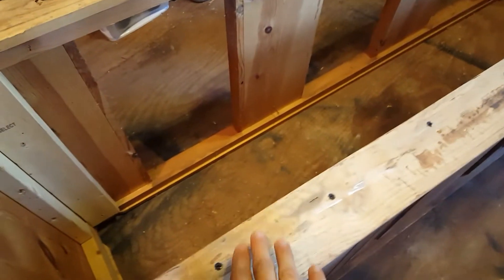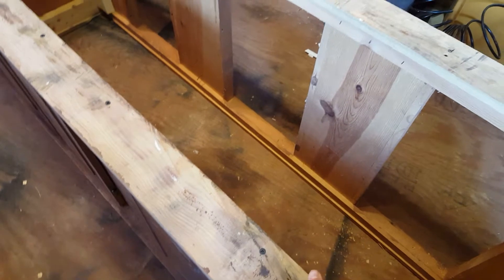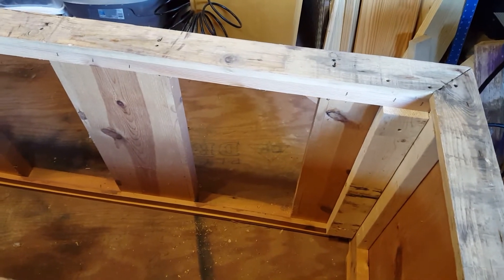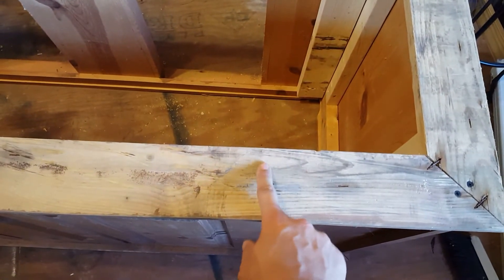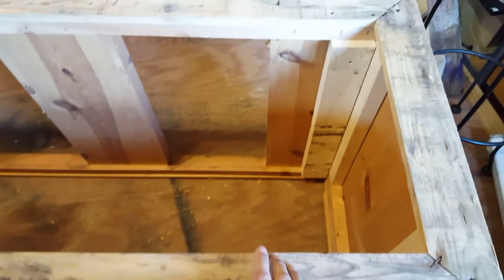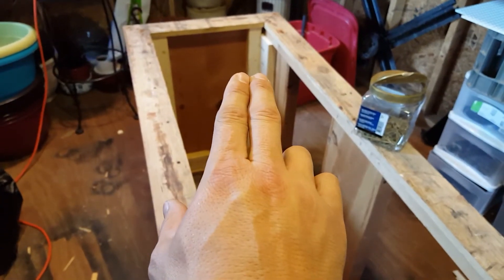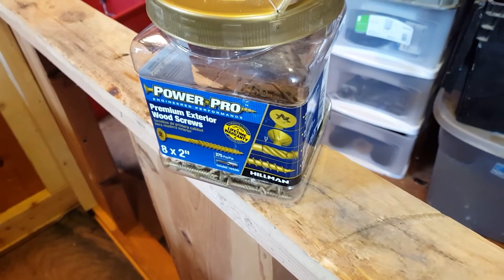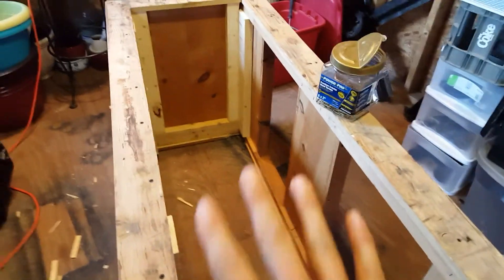What I've gone through and done is add screws to every seam, every connection, all the way through the entire tank. This is the bottom — it's still sitting upside down — and every seam has been reinforced with screws. For seams that aren't structural I used half-inch drywall screws, but where I added the two-by-four support at all four corners, I used construction screws from Lowe's — you can't use drywall screws for that.